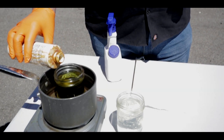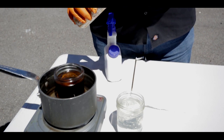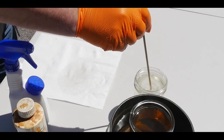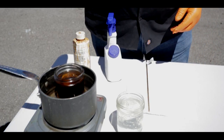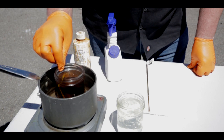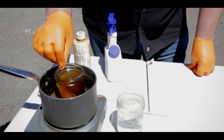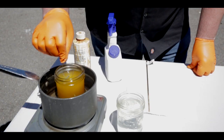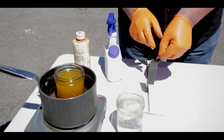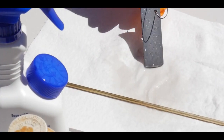We're going to pour some ferric chloride, which is traditionally used in other etching processes, and just put a little bit of it into our muriatic to see if we can get a little more color out of our sample. I'm going to stir that real quick. Ferric chloride tends to etch darker than muriatic, so I add a little bit of it to see if we can darken our etch just slightly. I'm going to neutralize this and then hit it with WD-40. And that looks great.